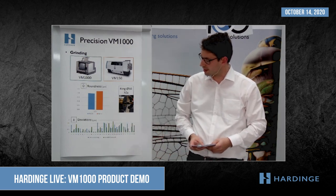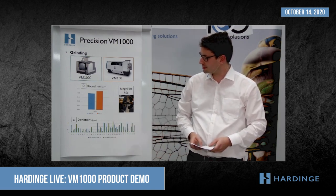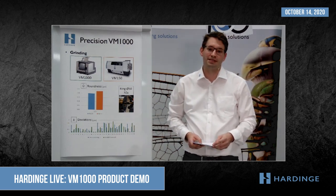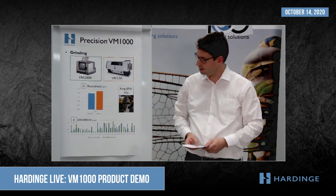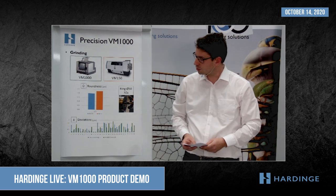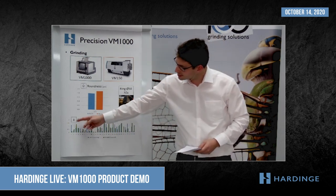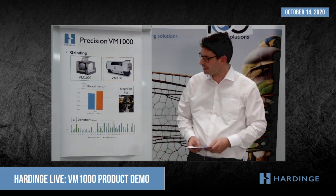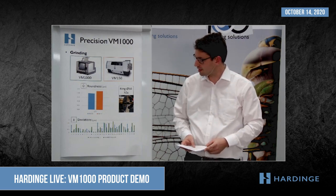Now, to the second or the last plot here, the focus is on the dressing of the workpiece. To be mentioned that every workpiece is dressed in front of the grinding. The focus during the dressing procedure now is on using the B2 axis. We have done one grinding and dressing combination using the B2 axis, which gives us the blue bars, and one without using the B2 axis, the green bars here. We have evaluated the deviations on the diameter. As you can see, both are very similar. We have good results on them.